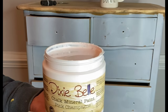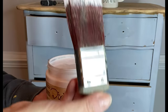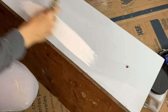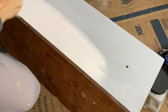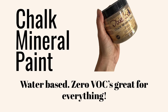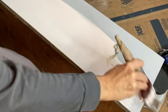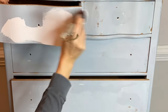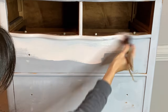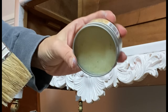So what's the plan for this piece? Pink — and pink it is. This is a beautiful soft pink called Pink Champagne. It is gorgeous and pretty, and we are going to apply two even coats of this chalk mineral paint color over top of the gray Bonding Boss. Using a Bonding Boss in gray or white before you begin really enables you to use less paint, especially with a nice light color like this. I painted the entire dresser but not the sides of the drawers. I sanded down all of the drawers along the sides to make sure they slide evenly and that no paint overlap prevents them from closing properly.